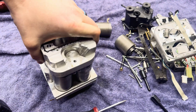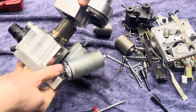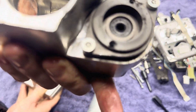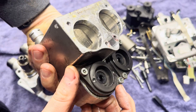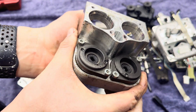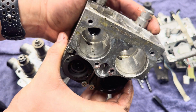I think I might need to get a hammer and tap that off. Oh yeah, that's definitely working. Now I think we've got some debris there that could be from like some brushes in the motors. I think we might be on to something on why this pump failed.